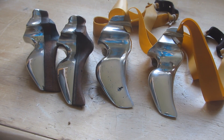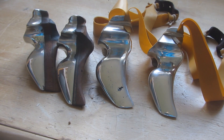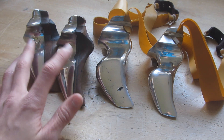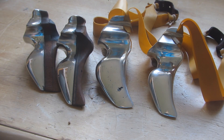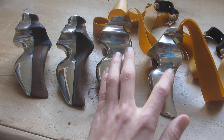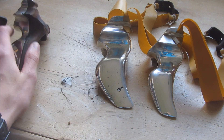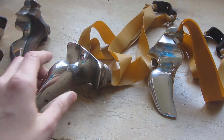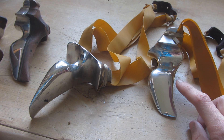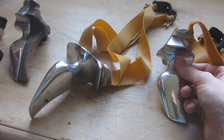This entire casting video series of casting four aluminium slingshots has been to find the best casting method. I haven't tried lost wax casting yet and might in the future, but it's mainly for small things like jewellery. The half casting method works well if you don't want to spend much time on mold making, but there's quite a lot of cleanup and sometimes imperfections. The two best methods were lost foam casting and green sand casting — if you don't have a slingshot you want to replicate, go for lost foam since it's easy to create one from foam. But if you have a slingshot you love and want to replicate, green sand casting is the way to go since it creates an almost perfect replica.